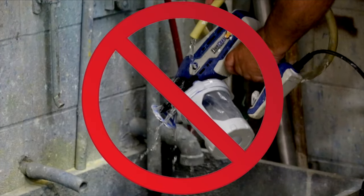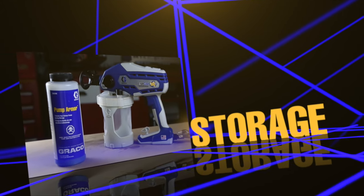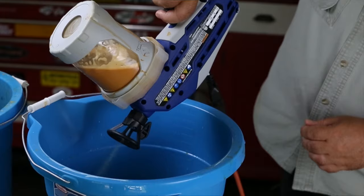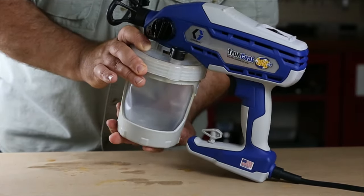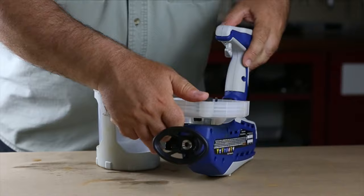The reversible spray tips will require replacement after heavy use or after spraying abrasive material — spraying with a worn tip will result in a poor spray pattern. Properly cleaned and stored with Pump Armor, your TrueCoat sprayer will be ready for your next project. Graco Pump Armor is available at your retail store. To properly store the sprayer, clean the sprayer and cup assembly. Turn the prime pump spray knob down to the prime pump position, make certain the vacuum valve cap is closed, remove the cup support and flex liner bag from the cup cover, and set the sprayer upside down on a flat surface.